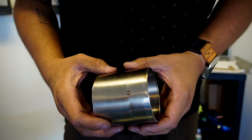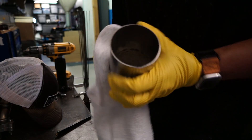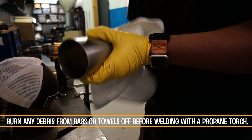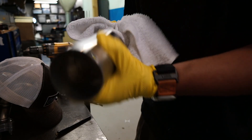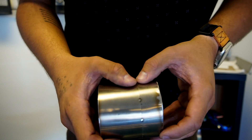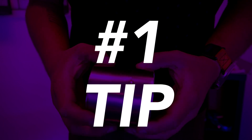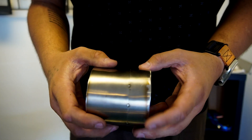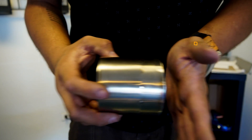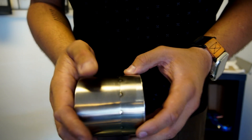Some people argue you absolutely have to back purge your tacks. On stainless steel I do not, because I don't get full penetration on the inside of the tube — they're just tacks, so there's no carbide precipitation on the inside. Just tiny tacks placed every inch or so, utilizing shrinkage to close gaps. If you have a gap you can add a little filler, go a little hot, and when that weld shrinks it'll pull the joint together. The number one tip for fitting up stainless tube for a good back purge: grind all the faces of your tube joints flush on a belt grinder so everything is perfectly sealed — no oblong or crooked edge creating gaps.